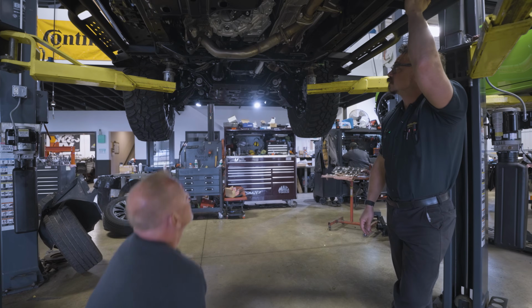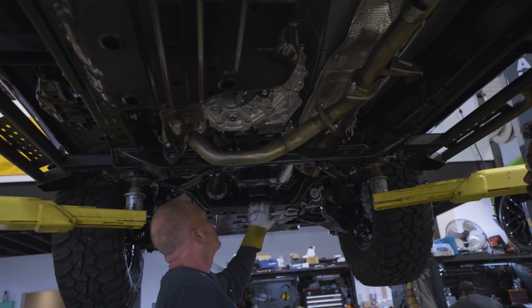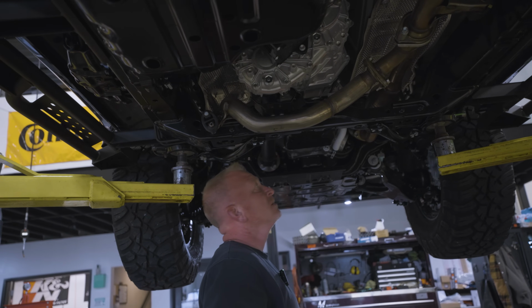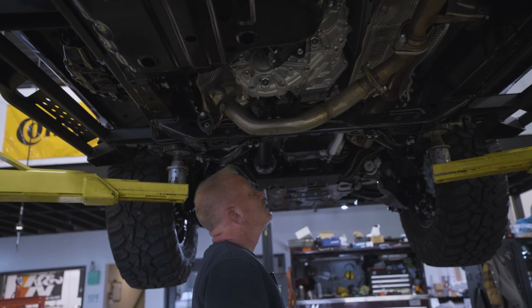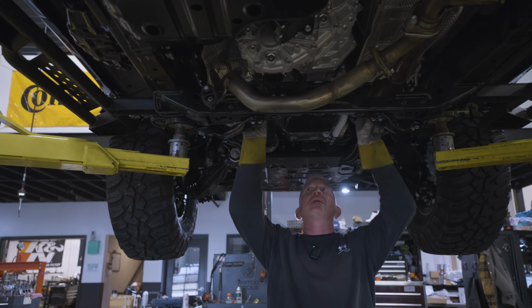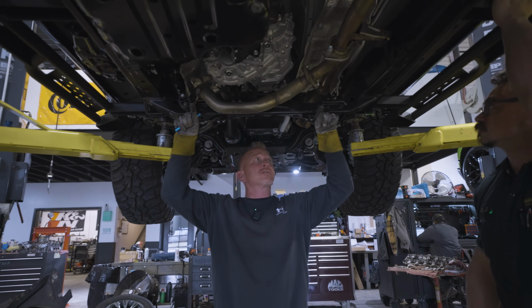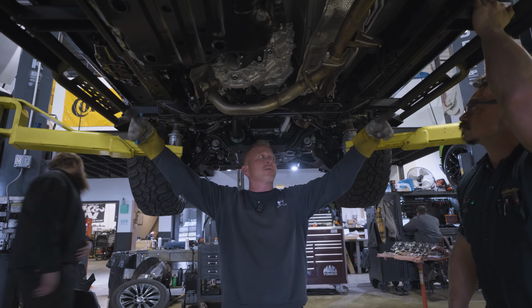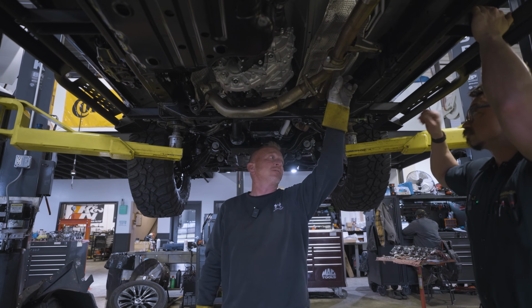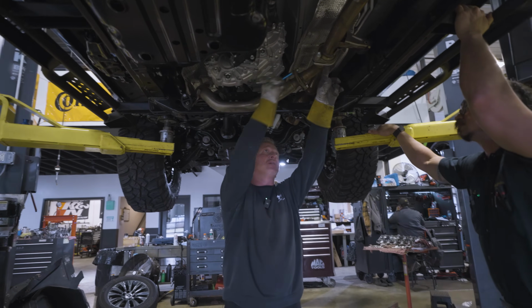Well, knowing all that now, actually, I think I'd put the X right here. Turn into it right away? Higher than this, yeah, turn into it right away because there's going to be a lot going on back here. Do the X right here, bring it out over the top. Now here's the thing, once we come over the top like this, we'll turn them out and go down, right? Mm-hmm. Now this one will be easy, a Y pipe into this. That's simple, right? But then we're also going to have to put another Y here to turn it into this side.